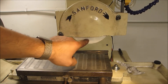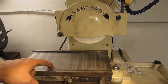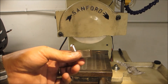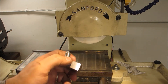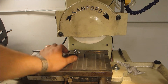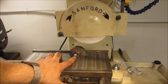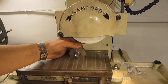Some of you may have noticed this is a different wheel than what I used to grind in the chuck - it's more adapted to what I need to do here. I may go in and regrind the chuck. The main thing I wanted to show you is my diamond and its holder. I got rid of the big set screw and put a small one in there, and this allows me to use the set screw against the backstop to dress the wheel.